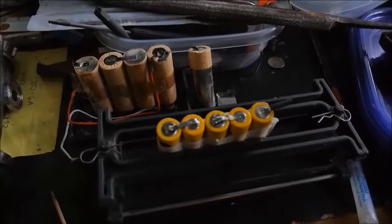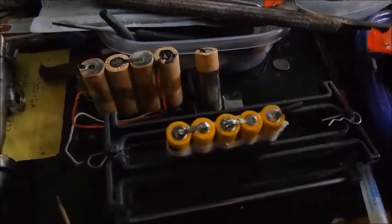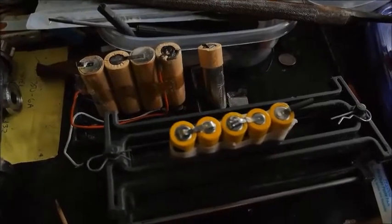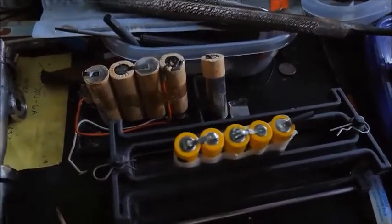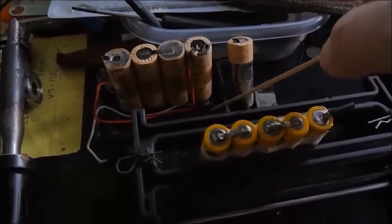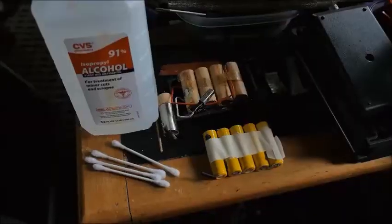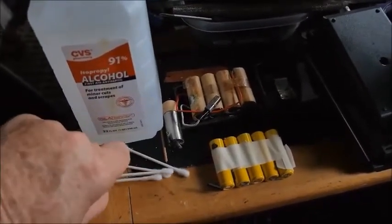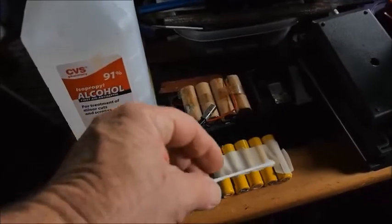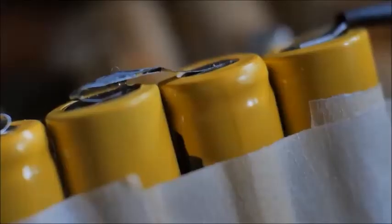I'm going to wrap it in some Kapton tape and then heat shrink it, so it has a wrapper similar to what it had originally. First I want to check out this other battery pack here - it's hard to see, but I want to check out these wire connections where they go down to those charging points. What I'm going to do now is take some 91% alcohol and go along where I've soldered and wipe the solder flux off. Then I'll take a very small piece of insulating tape and stick it between this point right here and the battery on each of these.